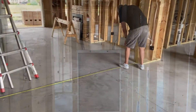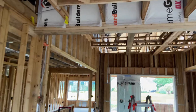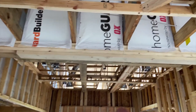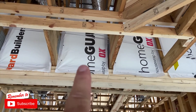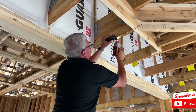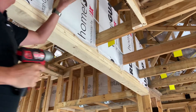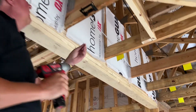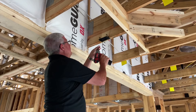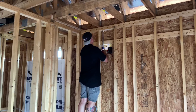We're taking a measurement so we can mount the access point in the ceiling. We just want to make sure it's located somewhere that's aesthetically pleasing. Once we have that figured out, we mount our low voltage boxes for the access points and drill all our points for where we have to bring wires down through the top plates. Here you can see me drilling one of those locations.